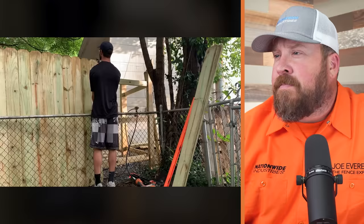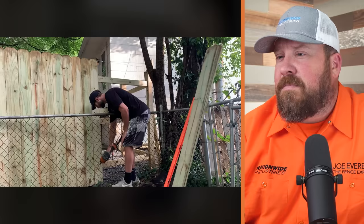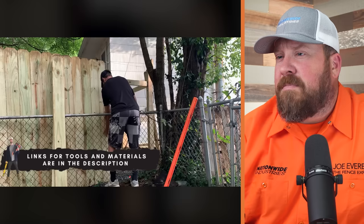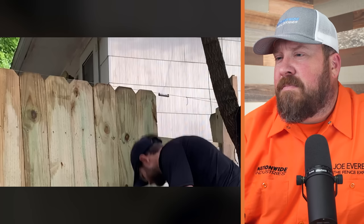A good rule of thumb: six nails per picket, two per brace, on a five-and-a-half-inch wide picket. Some folks will put three nails per stringer — nine nails total per picket — but I'm from the school of thought that two nails per stringer, six nails total, is absolutely adequate to hold those pickets on and keep them tight against that 2x4. He's checking the level with the line — two nails at top, two in the middle, two at the bottom. It's a very redundant job, but you go through each picket one after the other, making sure it's flush with the line.